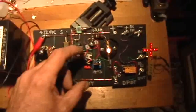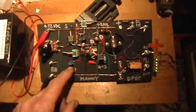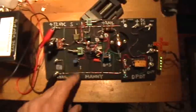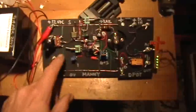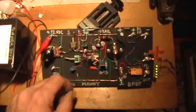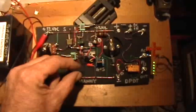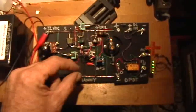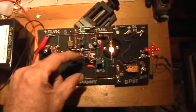This capacitor charges up over 4 volts and then discharges under 4 volts, either through this discharging resistor or through the discharging portion — the negative side of this potentiometer. So the gate voltage to this MOSFET is fluctuating up and down around 4 volts. It's turning on and it's turning off repeatedly.